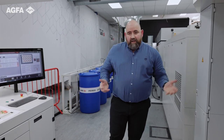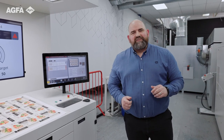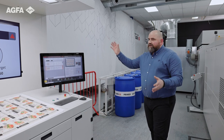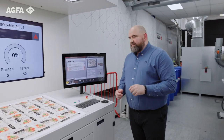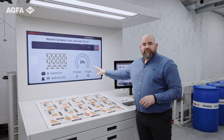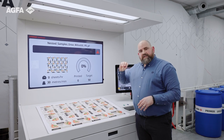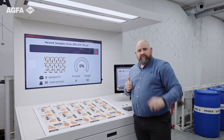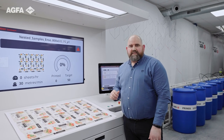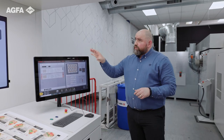As I mentioned at the start of this deep dive, we are intended to go satisfied pallet to pallet, stack to stack, so we need to ensure the quality. As we come around the machine — having now walked just under 25 metres, around half an Olympic sized pool — we're into the working area. It's a nice, clean environment with a GUI for the operator console. Here you see the user console with the live data analytics from the press, where intrinsic data comes from those confidence strips, showing the upper and lower limits of density to ensure nozzle performance and nozzle health for reliable printing.